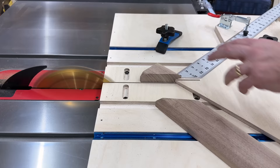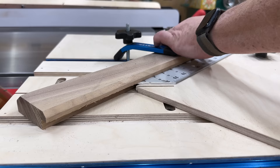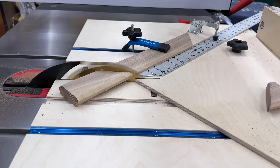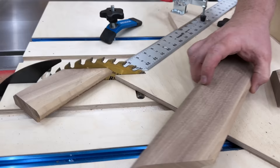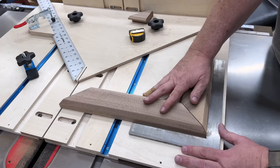For example, it will make picture frames and you're not limited by size. The front fence has a quick disconnect feature so you can make picture frames with sides as big as you like, and it's extremely accurate. The triangular guide that holds the sections of picture frame in place was cut using the rules of geometry — not with a tape measure, framing square, or speed square. It's cut so that it's perfect. The resulting angles are not accurate to a degree or a tenth of a degree — they're absolutely perfect, spot-on 45 degrees.